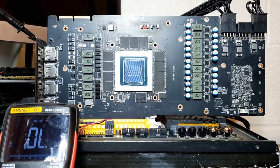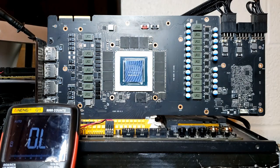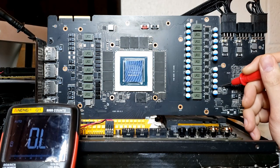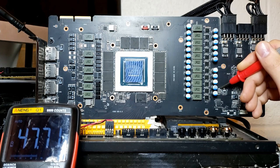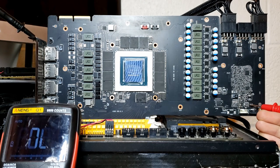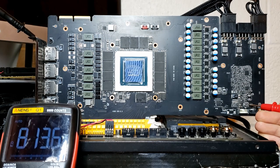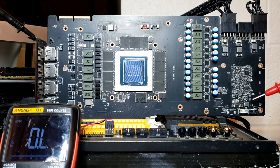Now let's go to resistance mode and check the actual voltage rails. First, this is a 5 volt rail — we have a resistance of about 47,000 to 48,000 ohms, which is very high. Checking the other 5 volt inductor, we have 813 ohms. I think that's probably high enough — I'm not sure if 800 ohms is normal given the other one is in the 47,000 ohm range, but I'll just note it as a concern for now.